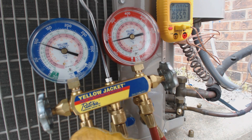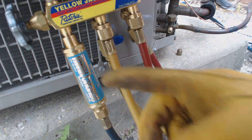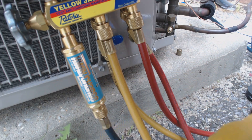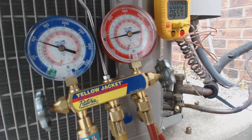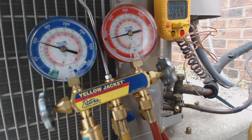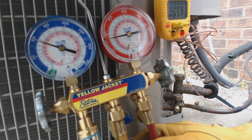Now we're going to get the air out of our liquid vaporizer on our suction line. You have a vaporizer attached to your blue suction line — that's usually on your gauge set for charging. It's not absolutely needed, but it's very safe for your compressor. All right, we got the air out of that line.